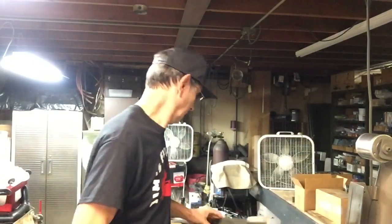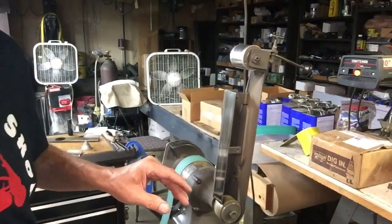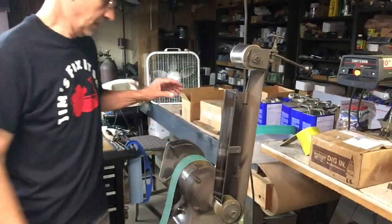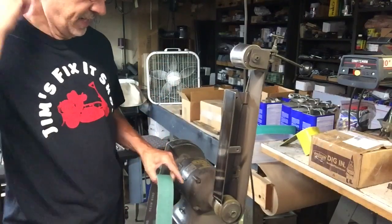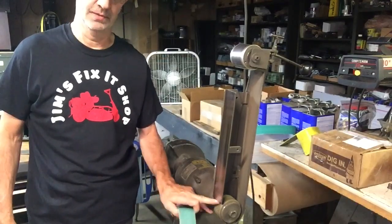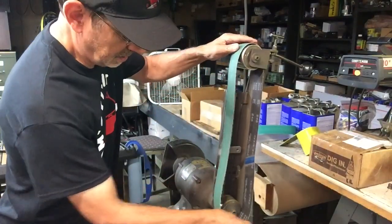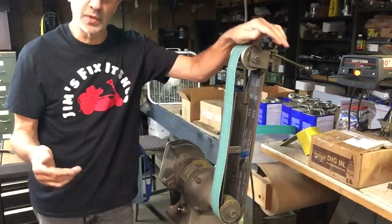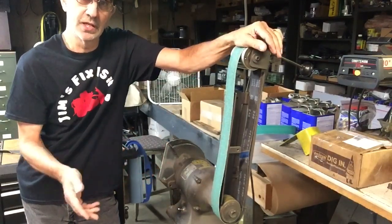It's not like trying to do it on a grinding wheel — I do it on a belt sander. These are all shop-made belt sanders, very simple design and easy to use. I'm using the 80 grit belt and it works quite well. This one is the only one with a rubber drive wheel, and it works better because every time the joint comes around on the belt on a metal drive wheel you get a bounce, and it's hard to get a good job.